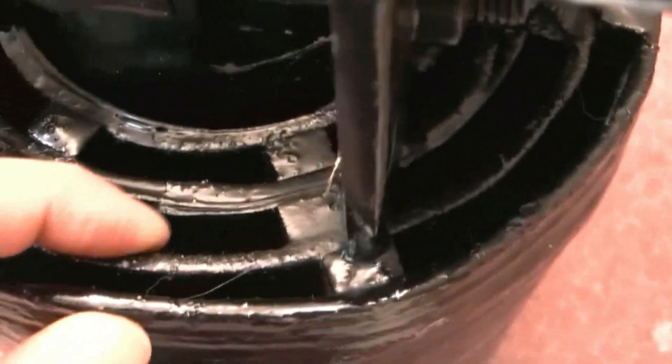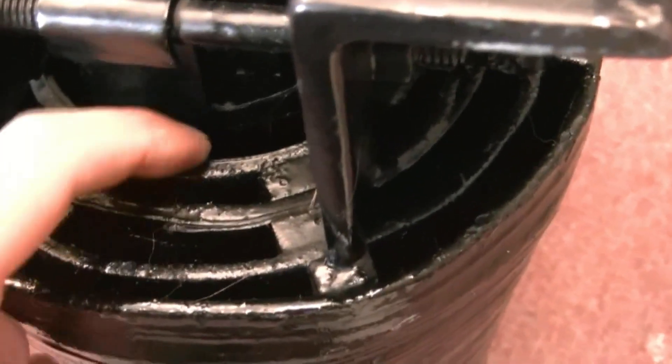Firstly, these are the primaries, which are quite close to the centre coil — so I'm going to leave those. Basically, I've got to take out these two, which are the secondaries, and I'm going to leave these primaries. Come around the other side — there are the secondaries, and I want all of those hacked out. It's quite thick wire, that.